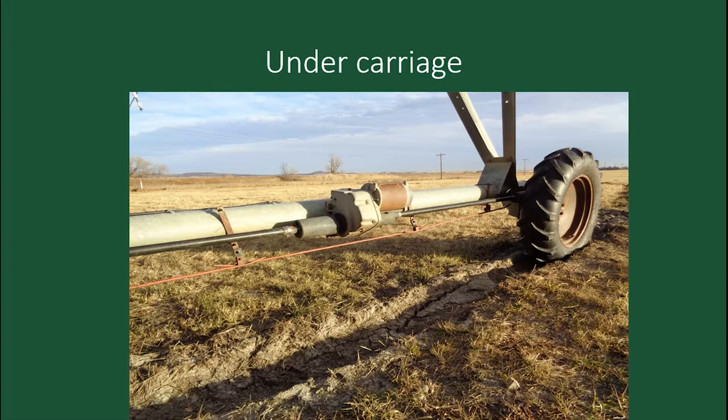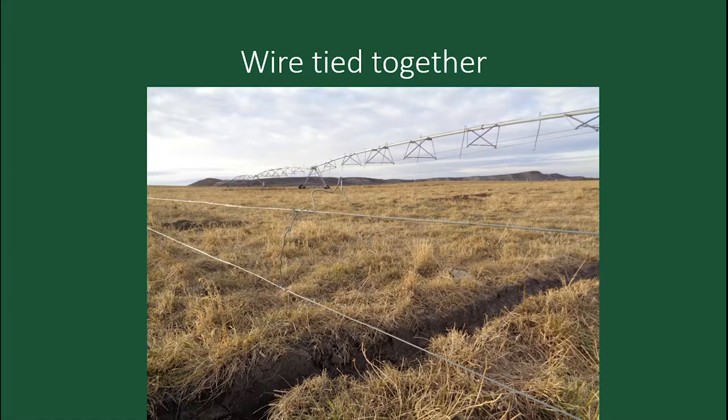This is how the pivot runs. There's an undercarriage that crosses over the wires. Wherever it crosses, we put two wires tied together — both hot — so the tires can walk over it. In some places with different soil types, there are quite deep ruts. They'll grab the bottom wire and pull the top one, and it walks right over. It's not a perfect system — the pivot runs over all the fence at a slight angle. Once in a while it will catch one of the wires and wrap around the axle, which is not a good day. Always check to make sure the wires are tied together so they'll walk over it.